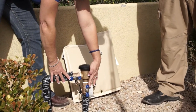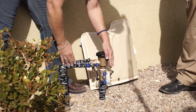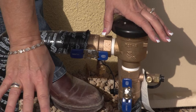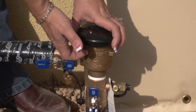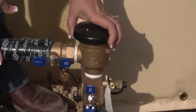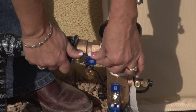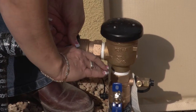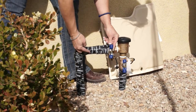These are your shutoff handles. The water comes in from one direction and then goes out the other to your valve box, and sometimes these crack under here from the cold, and if the heat gets on the pipe right here, it can also cause damage to the pipe. On this handle there's a little notch, and if I simply turn it where it looks like it's cutting the pipe in half, that shuts off this side right here.